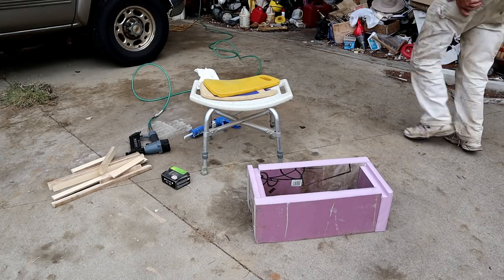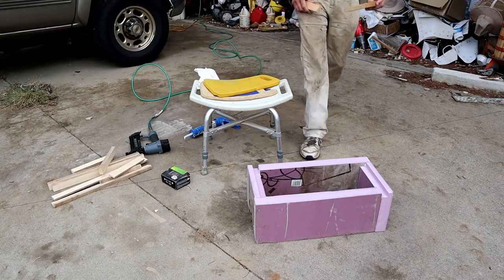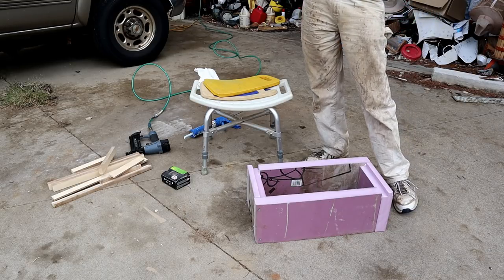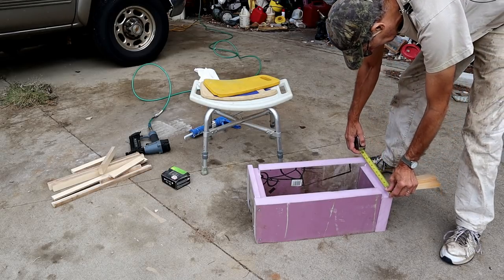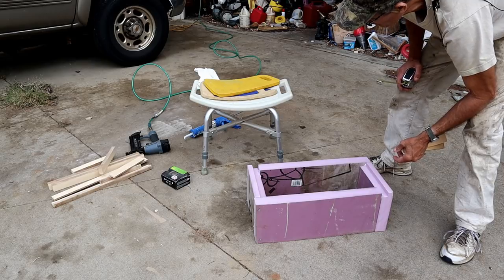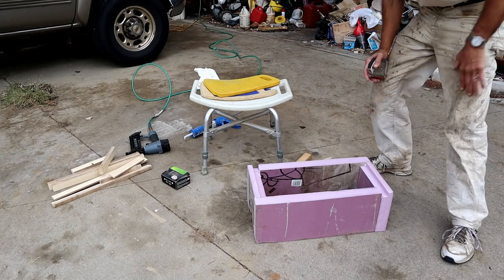You know, I'm going to have to go down and make that frame rest, because the frame rest has got to go in there before the top board goes on. See if these are long enough. Nope, they ain't. That's another thing on the cut list. That'll be an inch and an eighth by 9.5. I'll be right back. Gotta go make a couple of them.